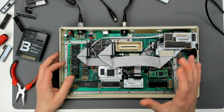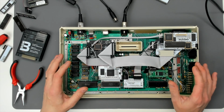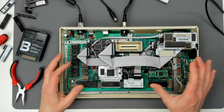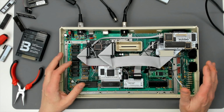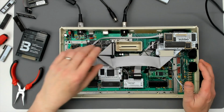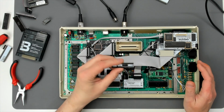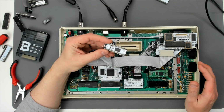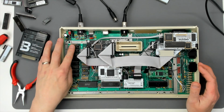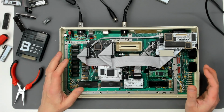So anyway, there was a comment on the video from somebody who'd had a very similar system. I can't remember the specifics of it as I'm talking now, but I'll flash it up on the screen and you can see for yourself. He said that he had all sorts of stability issues as well on a system. I don't know if it had O2 fixer offhand, but it certainly had the SRAM board. And what he ended up doing was taking the SRAM board out of the machine, going back to the original DRAMs, and that improved things, and the machine started to work.